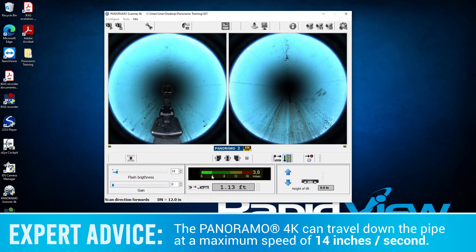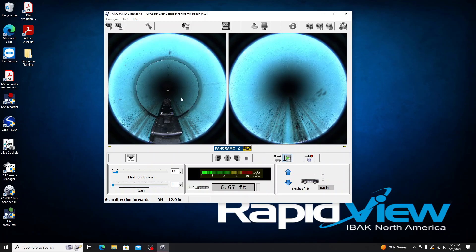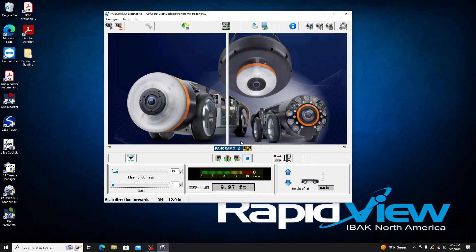I'll toggle to switch to the winch sensor and carry on with the scan. You can see the distance rolling up — I'm staying close to about 4 inches per second — with both the rear image and front image moving down the line. I'll run about ten feet here since it's a pretty straightforward pipe. Approaching the end, I'll slow it down, click to stop the scan, then click End Scan, confirm yes, and the scan interface closes.